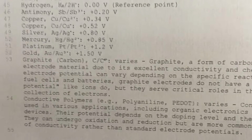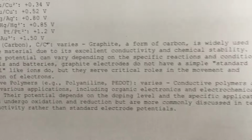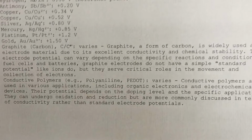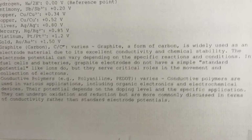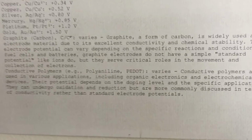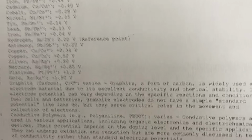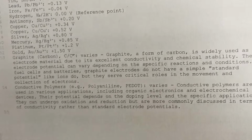Now, using other materials that are conductive but non-metals like graphite, carbon, and conductive polymers, as you can see, it gets very interesting. And the voltage will depend on other systems such as the electrolyte, the quantum tunneling, the electrostatic, and other systems that I've talked about instead of traditional electron flow. So maybe that's what originally confused people, because I didn't think that the carbon at first was non-metallic, and it isn't. So it doesn't have that same electron potential, even though it does have a work function.